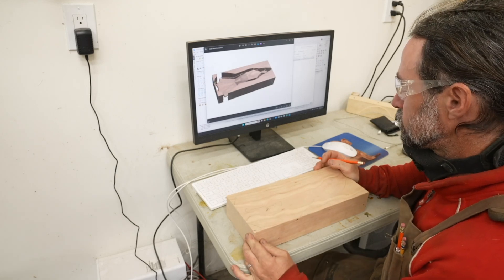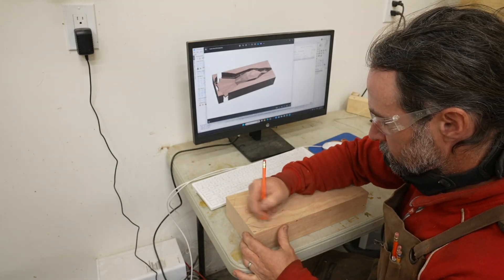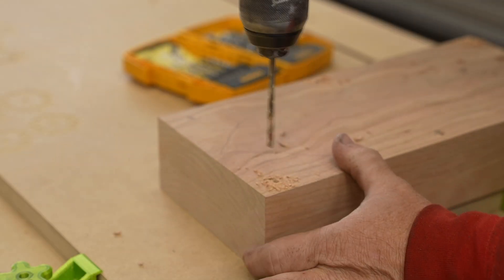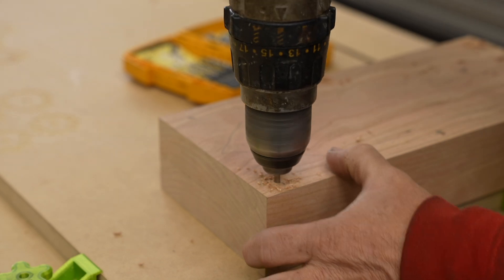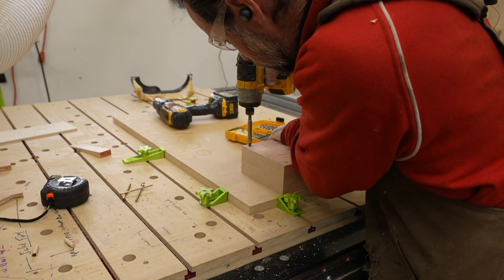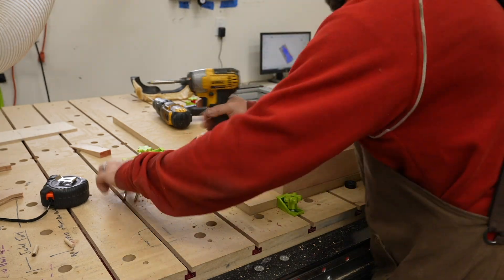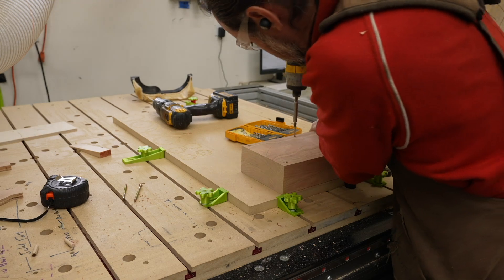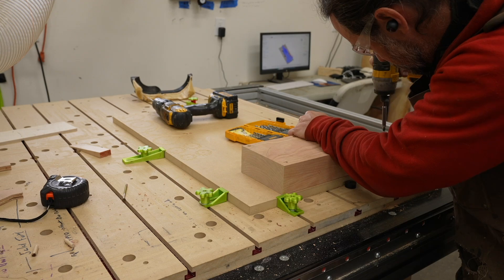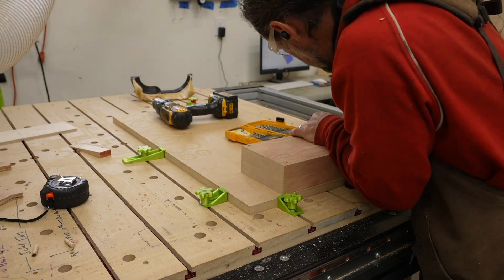For the bird body, I decided to use Vectric V-Carve to carve it out — and this was a mistake, as I'll show you in a little bit. One of the things you can do is run the simulation and see where there will be some empty area. Inside that empty area, I drilled some holes to screw down the piece and hold it onto my table. I'm not a big fan of using screws to hold down your workpiece because it ends up wrecking the spoil board, and you probably can't use the same screw hole in the same spot again without it moving around. You also have the potential to hit the screw — which eventually I did.